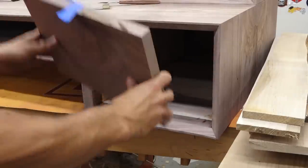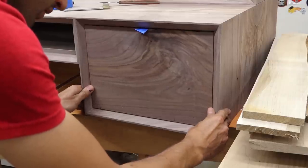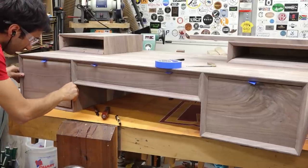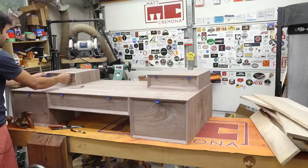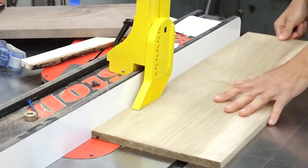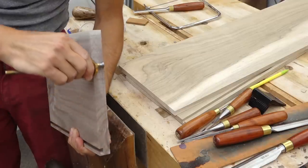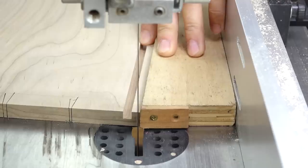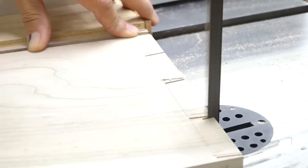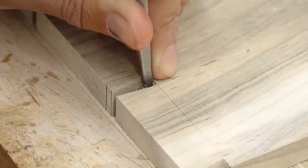I'm going for a drawer front that fits perfectly to the width of the opening, so when I clean up the dovetails later on, that'll remove a small amount of material and make these drawers a nice piston fit. Once I have all the fronts taken care of, I can finish up the stock for the drawers, ripping it to width and cross-cutting it to length. And while I'm at it, I can also make the groove which will hold the bottom. Now we can start on some joinery — the front of the drawers will be joined with half-blind dovetails. I'll cut the tails at the bandsaw with a taper jig which matches my desired tail angle, flipping the board after each cut to create a symmetrical layout. I'll clean up a bit of the waste at the bandsaw and head back to the bench to work back to the scribe line with some chisels.